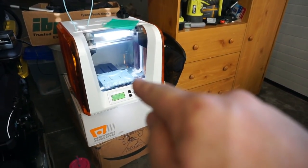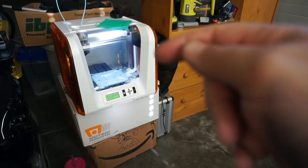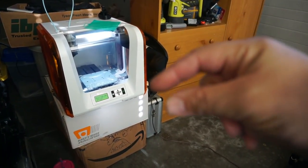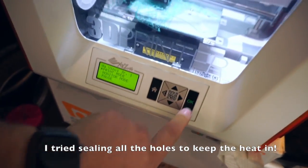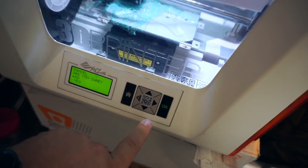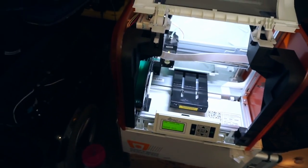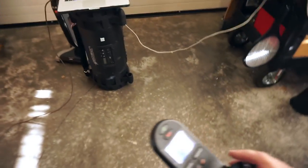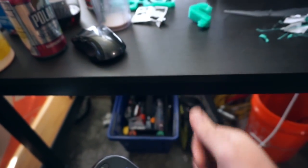This is a problem with not having a heated print bed. If it had a heated print bed, we wouldn't have these issues. Because what happens is, as the layers go down they cool off, and then as hot layers get stacked on top, when they cool and contract it pulls the edges up. I'm going to go ahead and say that this machine is not capable of printing this part. Look at that — it broke loose a long time ago and it's just been going crazy in there. Well, you win some, you lose some. It's much better at small parts than bigger ones. Last night we printed this GoPro adapter without any problems at all.